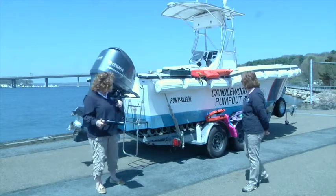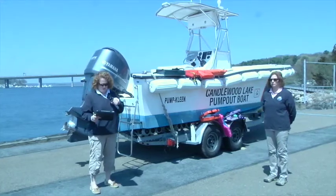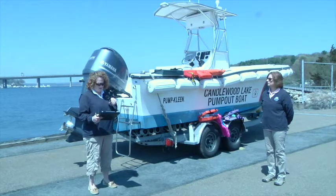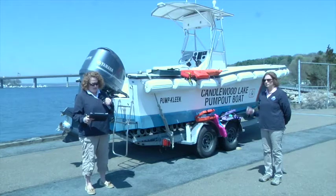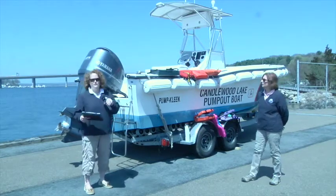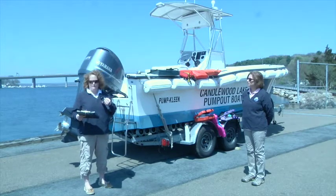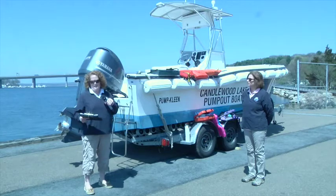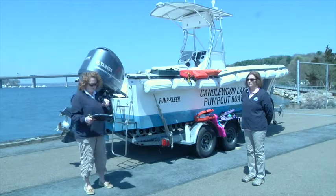Those are submerged in water, salt water, and electricity. You know what happens there with corrosion. Those lights also burn out as well. You want to make sure the bulbs are working. Test your winch, and also inspect the frame. Just look for general deterioration on the frame, and if you see any rust spots, then you should sand that and paint that to prevent further deterioration of that.